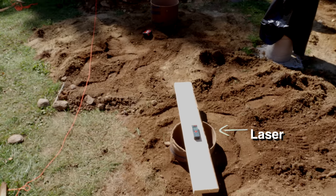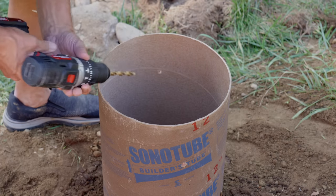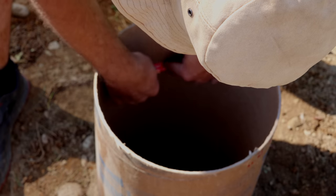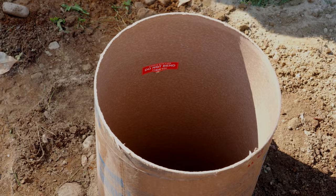I had thought there was no way I'd be able to dig all the holes to exactly the correct depth, given the slope of the yard, to get all the tops of the tubes level. So I got creative: I'd just fill them all to the same level using a laser, drill out where the laser hit the tube, and use the differential from the laser to the top of the tube to mark them appropriately. This wacky system might have worked if I could have been confident the laser beam itself was level — but for that I should have bought a self-leveling laser. What I actually got was a laser measure, thinking it would kill two birds with one stone. But it wasn't a level laser and didn't serve this purpose.